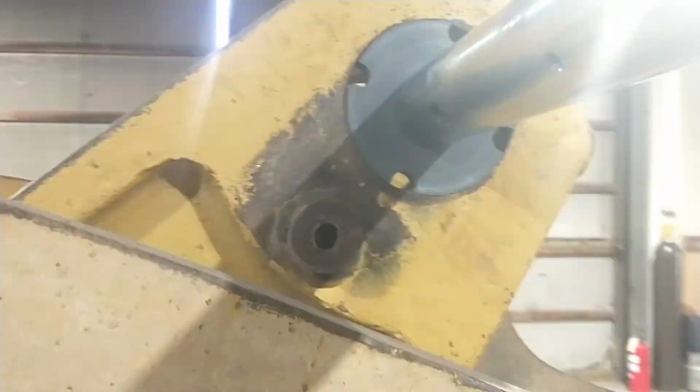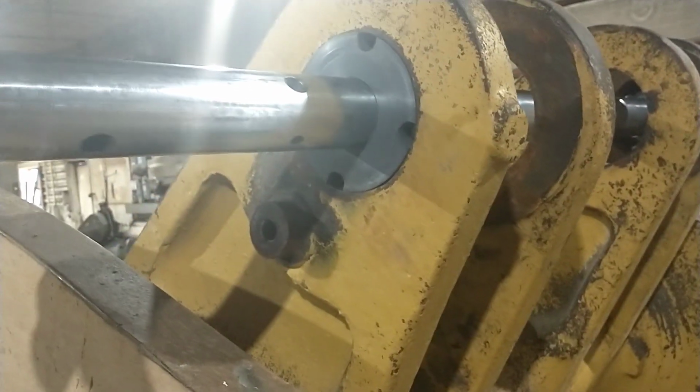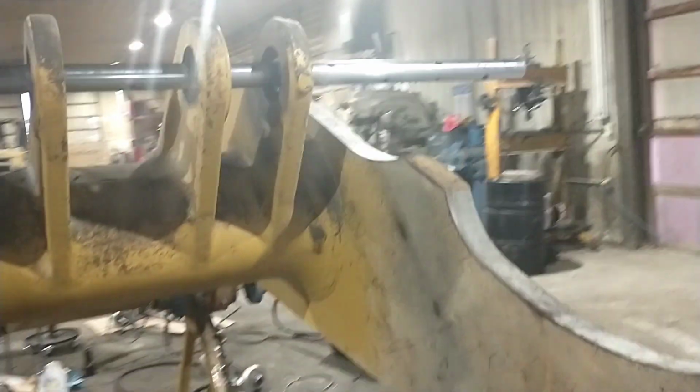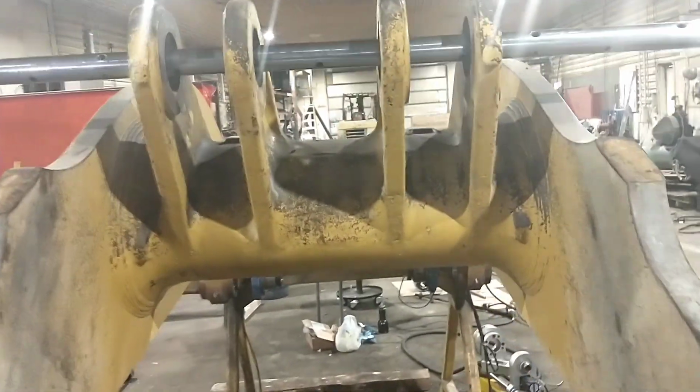Now one thing, it's a little hokey maybe, but they're just flexible enough that if the hole's a bit out of round and you make them a little tight, you can smack them in there anyway and they'll center themselves up. But as in this instance, that locks the bar up in there because it squishes the thing a little bit. But it works really good, and I gradually save these every time I make a set like this, and I keep carrying them around with me.